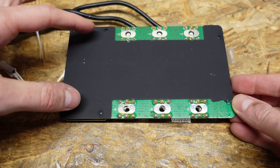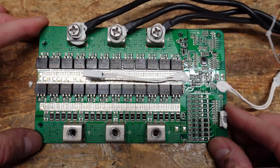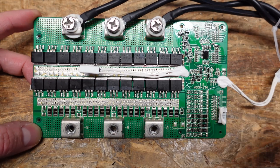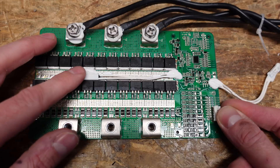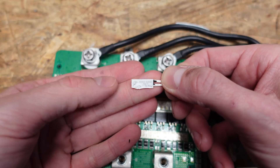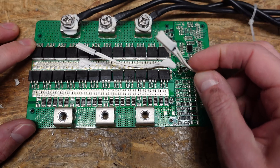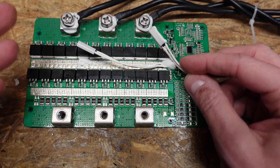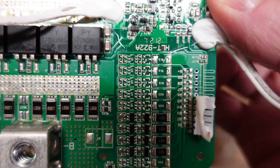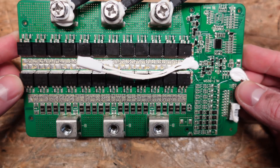On the bottom of the BMS I removed four Phillips screws on the left side and two on the right side, and pulled the cover off. Someone had commented asking how I know there aren't more sensors inside the BMS itself — that's a great, valid point. Upon taking apart the BMS, there is another temperature sensor situated within the MOSFET transistors — also a thermal switch, but this one is rated for 105 degrees Celsius instead of 75. So really they have no actual temperature sensors on this board. There is no way for this board to measure temperature — only these two thermal switches. I've carefully looked over all the components and see nothing that looks even remotely close to a temperature sensor or a port for an additional one.